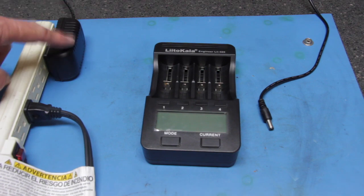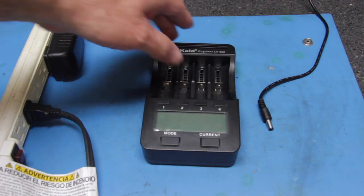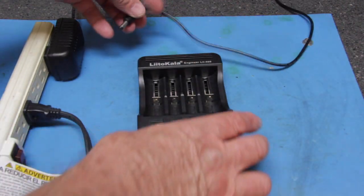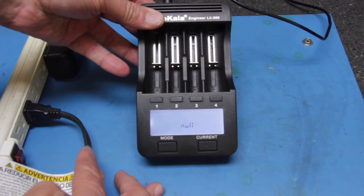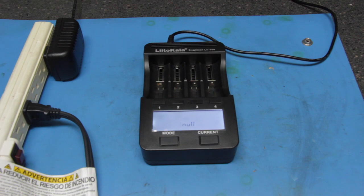Let's do a test now. I have the AC adapter plugged into the power strip and my battery charger here. I'll plug the adapter into the charger — and as you can see we now get power. That fix of replacing both capacitors worked, and that's a pretty easy way of repairing AC adapters. Usually what happens is you blow a capacitor or two. If you really fry the thing you may see a burnt hole in your board, but usually it's just capacitors. Hope you enjoyed this video and we'll see you next time. Bye.